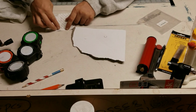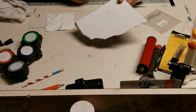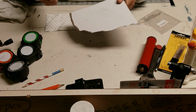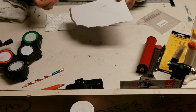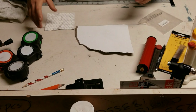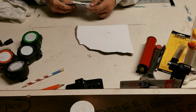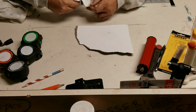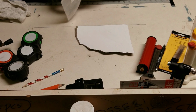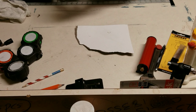Then you can put a cap over it. So in the back of a cabinet, a side panel where a fridge is, anything like that, I use headless screws. So you can put a screw in there, whatever. They're just good to have. And you can make them out of any color you want. They also make different color waxes. They have a wax kit. I think it has 30 different waxes in there, and you can blend and do whatever you want. But I keep these little caps around. There's some other stuff that's even better than these.